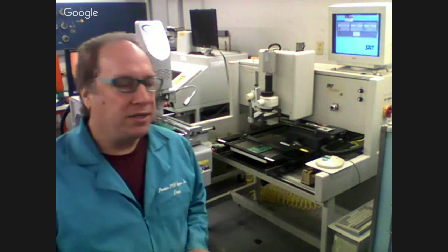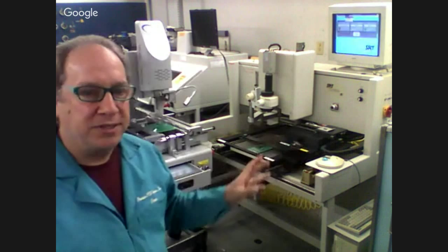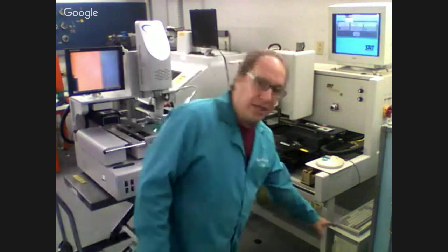It's a small, high-resolution HDMI camera. Look at the SRT and you have a camera attached to a microscope — that's really old technology and rather expensive. The microscope and camera are probably up in the $3,500 range. The vision system on this machine is expensive, and it requires a video card in the computer which, if it goes out, is also expensive. If any BGA workstation still has a standalone desktop computer running it, that's archaic — computers don't last long.